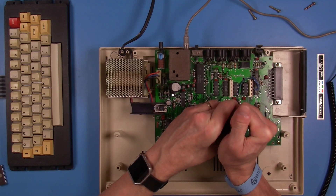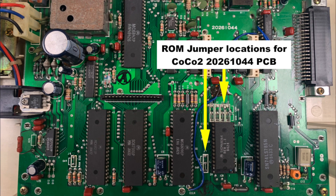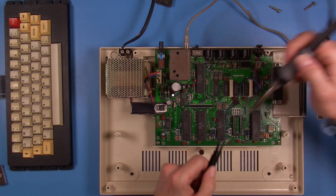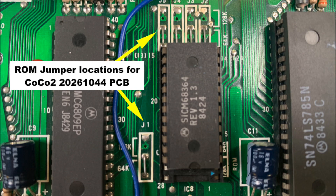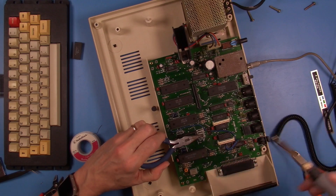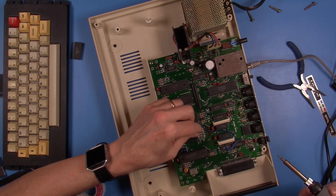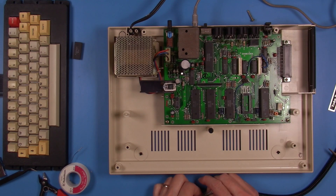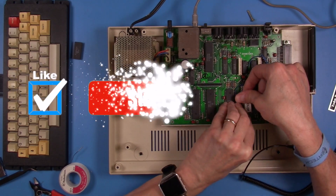Because the ROM image is a little small, I'll be putting multiple images on the ROM just to fill it out. Also very nice on this board is the jumper configuration — it's already set up so you can configure jumpers for either the 24-pin chip or a 27C series 28-pin chip just by changing jumper locations. I chose to clip one side of each jumper, bend them around, and solder to the other pads rather than removing them from their through-hole positions, then installed my new ROM chip.